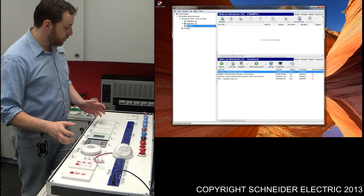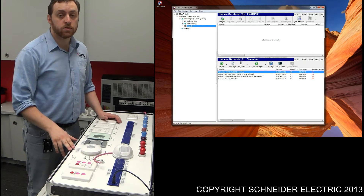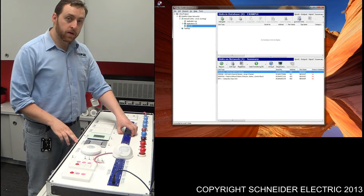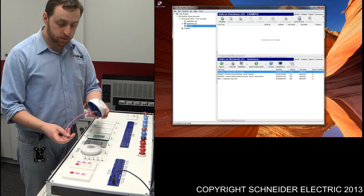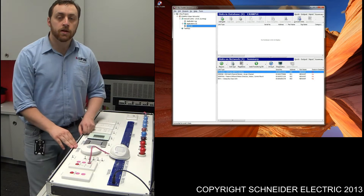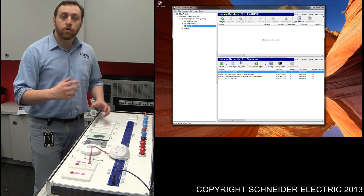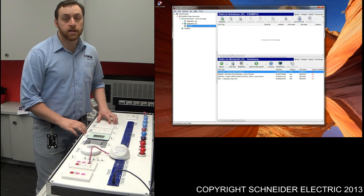Within this exercise we'll be using one of the CBUS training boards used for our CBUS basic courses and touch screen courses. The components we'll be using include an 8-channel dimmer with an onboard power supply, a 90 degree sensor, and a USB PC interface. I'd recommend using the Clipsal CBUS PC interface, as using adapters can cause problems. Later on, when we program override switching, we'll also be using the single gang key — a standard 2000 range.